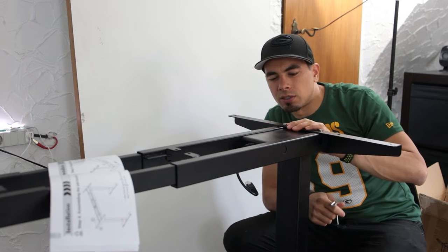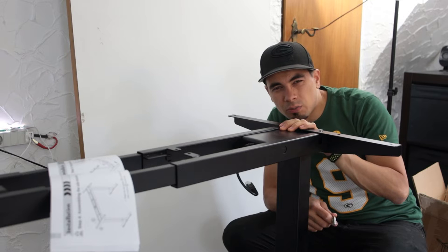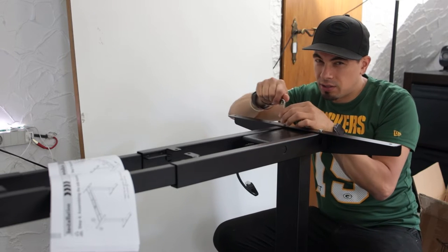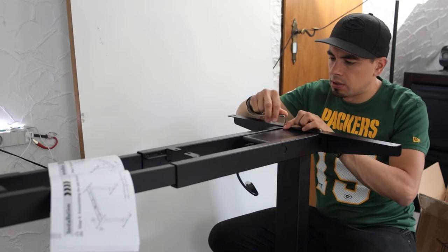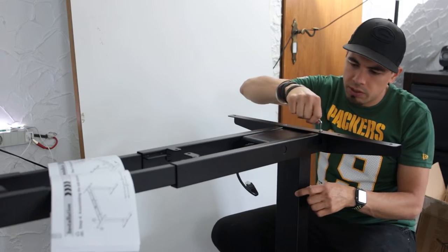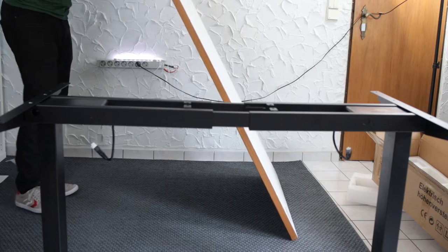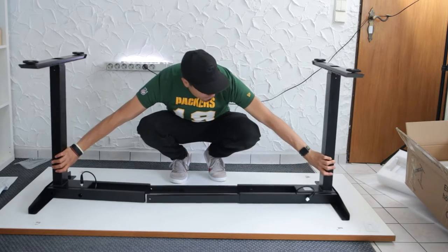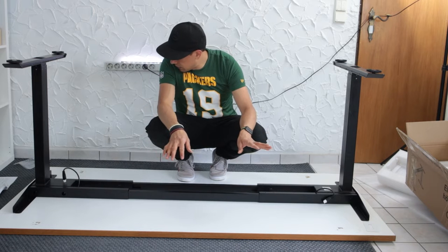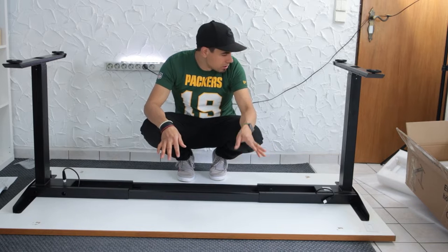When you do metal fasteners, I always find it's helpful to not fasten one side down all the way prematurely. Just give it a semi-tight fit, then connect and make both of them tight. Otherwise, you might have one down so hard that the other one can't move into place where it's supposed to be. Alright, so I think this is more or less how I'm gonna connect it. I'm still gonna go grab a measuring stick to make sure I have all the same distances everywhere.